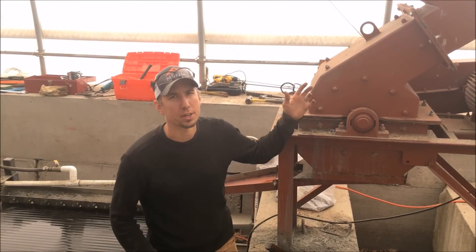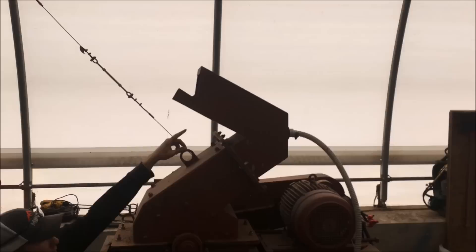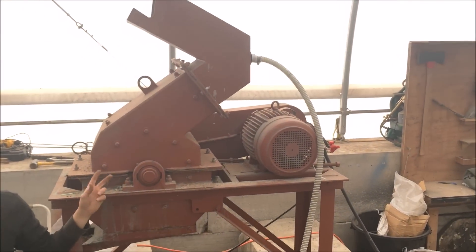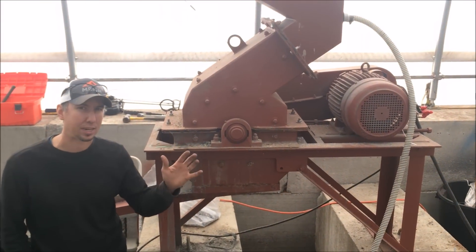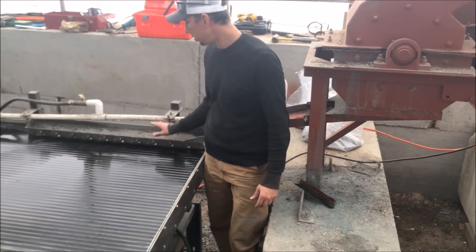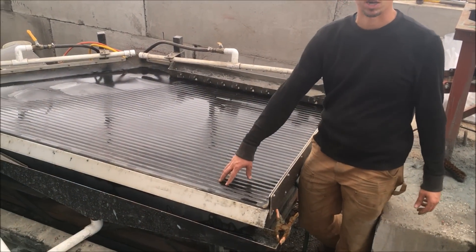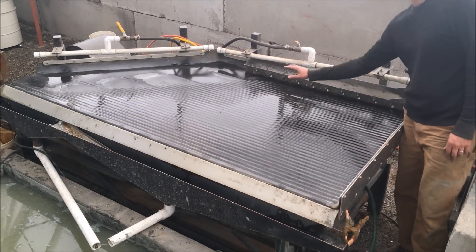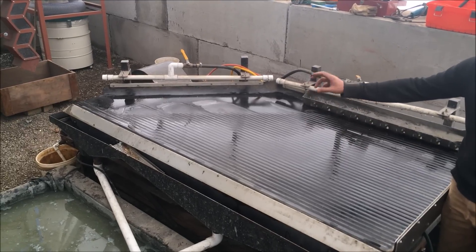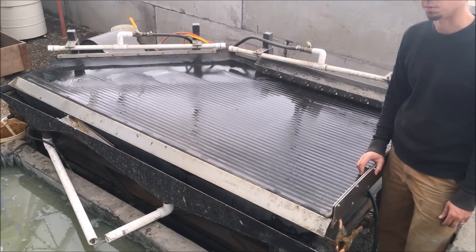Here's the system we're going to be using today — this is our demo system, a 16x12 hammer mill. It has a gooseneck inlet so I'm going to feed the material in here at the inlet. Water is fed up into the back of the hammer mill to help flush everything down and through the system. The hammer mill has a quarter-inch punch plate screen, and those blades we've shown in previous videos — so they're not hammers, it's more blades on this system. It's going to come down out of the trough into our aluminum distribution trough onto our shaker table. The table has gated valves so you can adjust the feed rate. The light plastic fluff and paper will go into the waste port. The copper will get caught in the grooves, run across under the concentration water bar and into number one and number two ports. Number three we'll see — I suspect there might be a little plastic mixed in, and some longer hair wires may get captured there that we can rerun through the system.